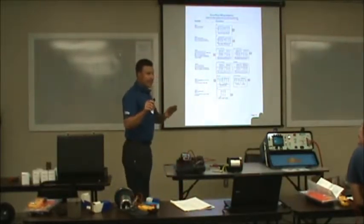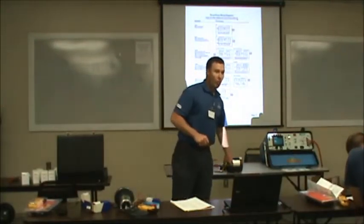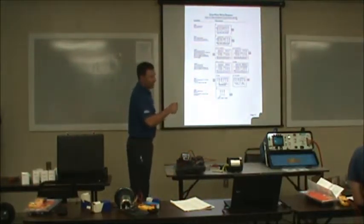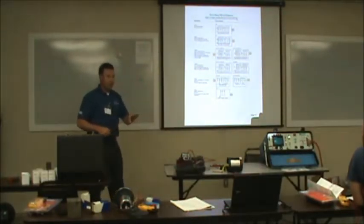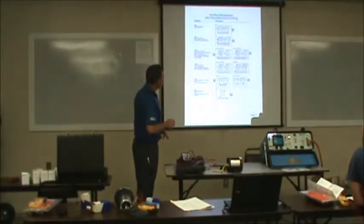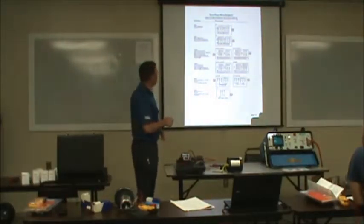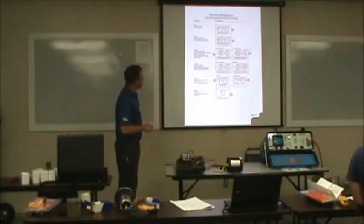You've got to follow these lines, and this is where it can get hairy, because this is what it's going to look like on the motor nameplate, or wherever you're looking inside the wiring box cover. This is what you're going to see. You've got to follow your line. It comes up and then all go to line one. So we're on a low voltage connection on a delta connected nine lead motor. We're going to have three wires to a lead. High voltage, we're going to go back to series connection, and you're going to have one coil or one wire to a lead.